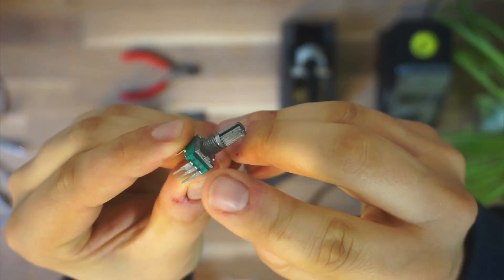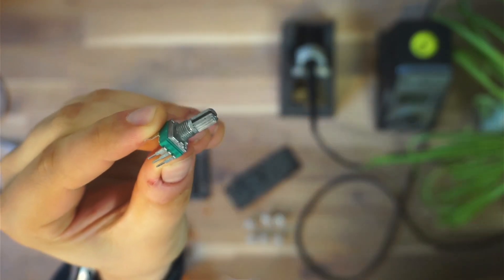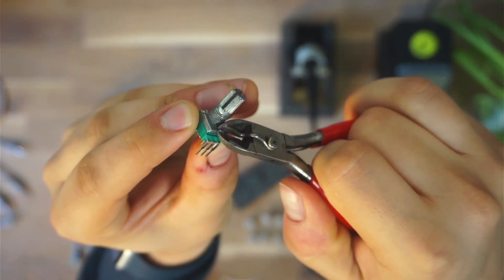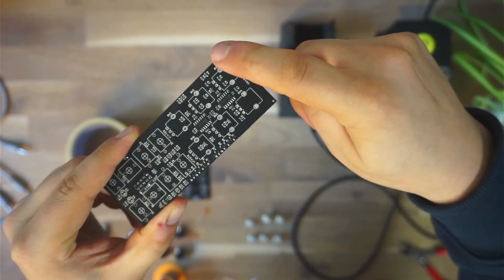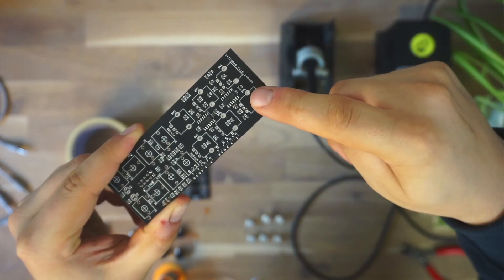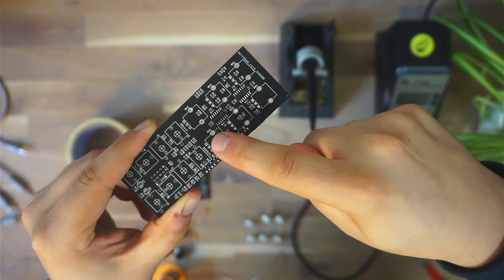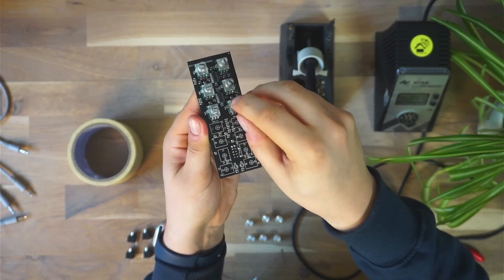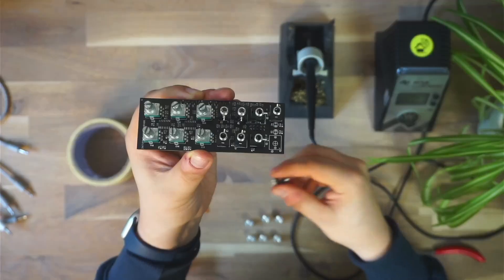Let's put away the tape and move on to the potentiometers. As you see here, we need to snip off this little thing — this is what the wire cutters are also very useful for. Snip and they're off. Now we need to put the potentiometers in place. Right here I'm checking the destination where the pots go — you need to check that in the BOM file. And yeah, put them in the right place.